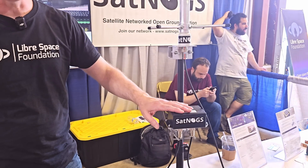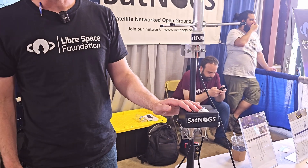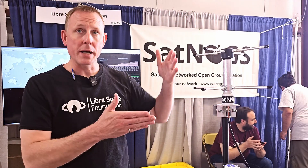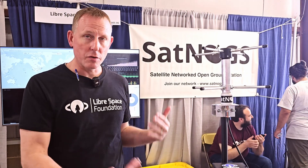This is just a low-noise amplifier and a bandpass filter. It really depends on your location — if you have a lot of interference, then you need a bandpass filter. It's not strictly required, but in a kit version you want one that works for whoever buys it. You can also run with a duplexer: a lot of people have a UHF antenna and another VHF antenna, combine them together, and now with the receiver tuned to one band you can listen to both bands.